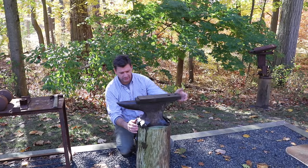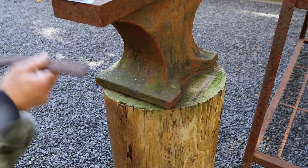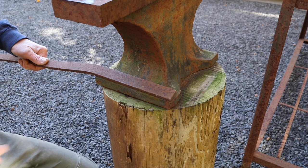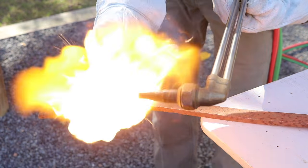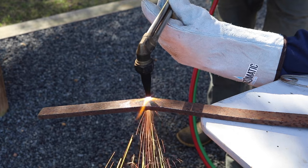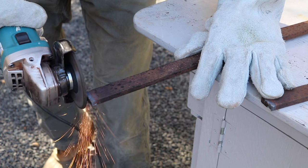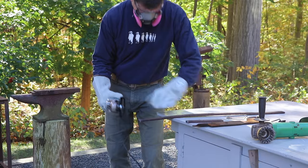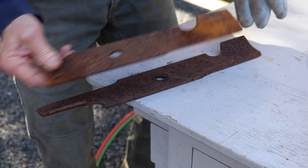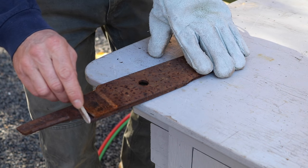This week I used a little scrap steel to make these clips that now hold the anvil to the post. I'm gonna get started by first cutting two pieces of steel about the length of the bottom of the anvil. These are old lawnmower blades — I cut this one to length with the cutting wheel a few weeks ago, and I'll just use this one to measure off the second one.